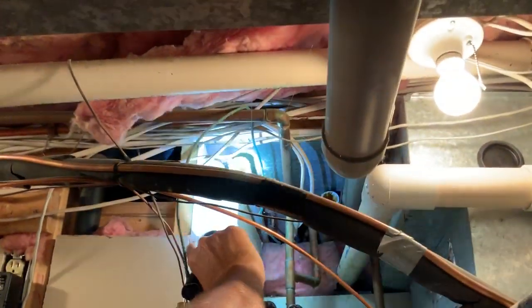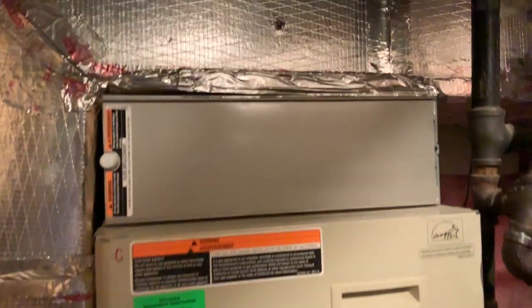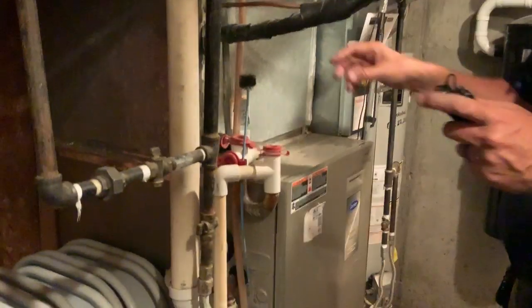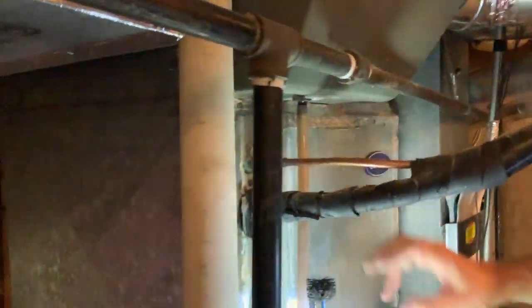Notice these have an exhaust pipe that's plastic. They also have an intake pipe that's plastic. This one is drawing from the basement — it used to draw up here. There's a cutoff pipe up there. They've altered the piping as they upgraded these units over time. Filters all change — this one changes here, the one to your right changes down low. The insulation here has been shorted about an inch. As a result, it sweats and drips down — that's the blue drip — and it can go down and short the motherboard. You need about 35 cents of insulation on there, on this one and on the one behind you.